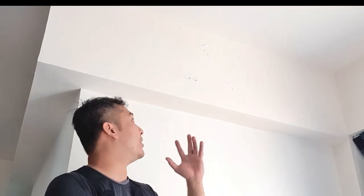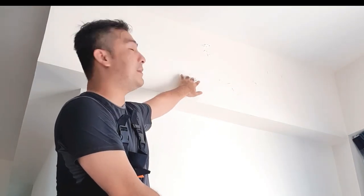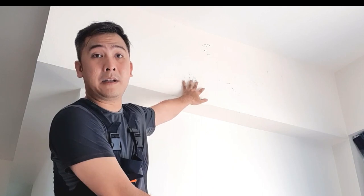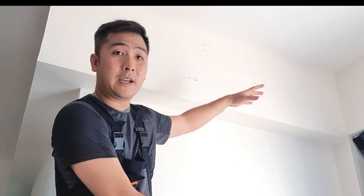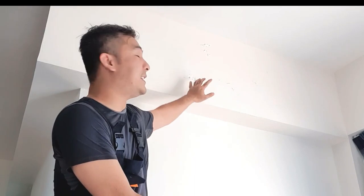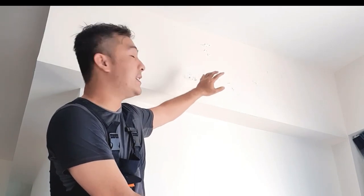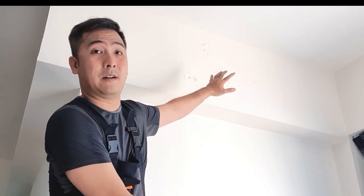Hi everyone and welcome back to the channel. In this episode we are going to be talking about drywall repair. Some contractors have removed the air conditioning and filled up the gap with silicone caulking and have kind of done a bung up job about it. So we have to scrape off everything and patch it up with something called a California patch. If you have a dent or broken drywall, this is the best way to patch your wall surface and prep it for painting later on.